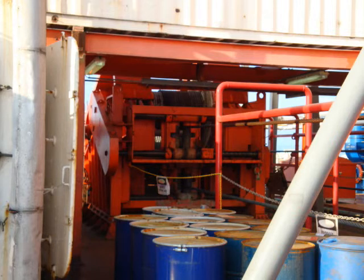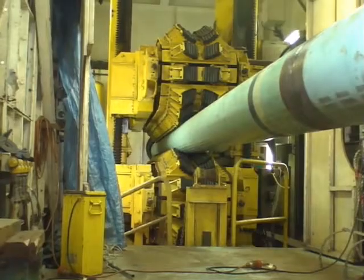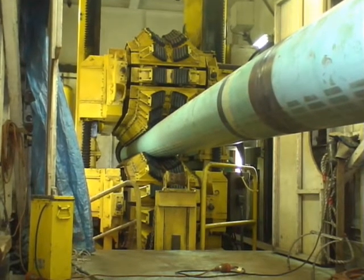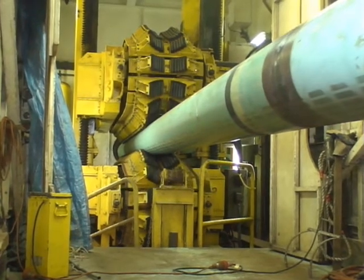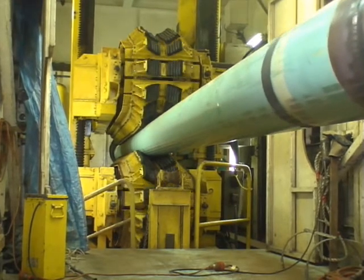During pulling pipe, the forward winches are pulling an approximate load of 20 tons each. The Robway Tension Monitor measures the load the anchor cable is under, and that information is displayed in the tower. The tensioner machine holds the pipeline with a tension of 48 tons and can grip the pipeline with a tension of up to 60 tons.